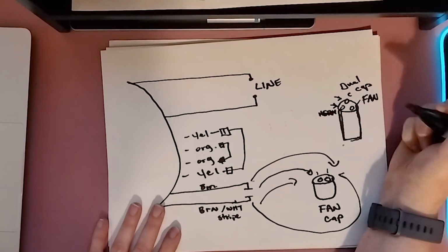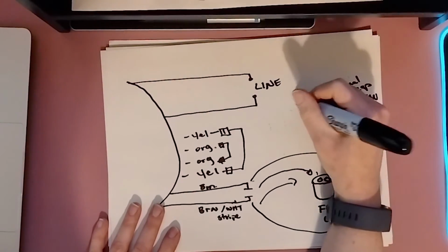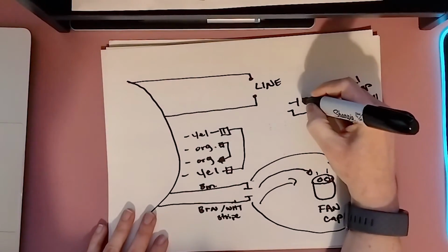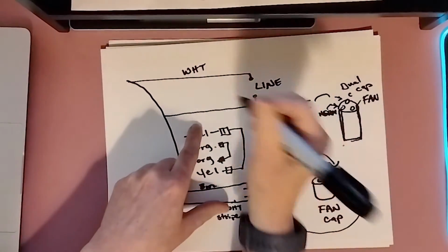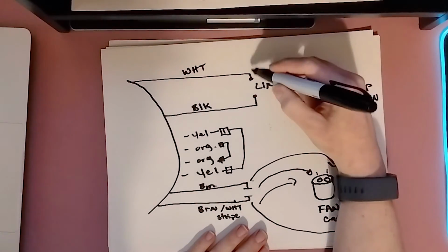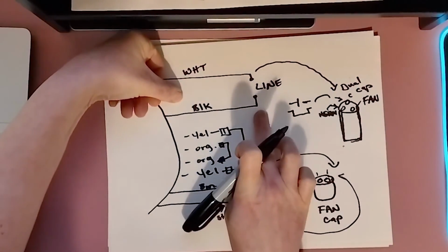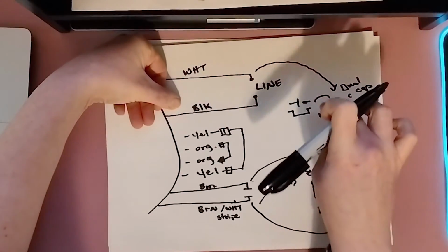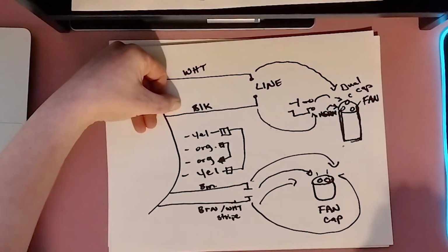Your compressor still needs power. So that compressor wire needs to stay on there, and that power wire that's jumping over to the contactor needs that power. In order to make this super simple, because there's a number of ways you can do this, put your wire, and again, we're just using placeholder colors here. We know line and line. Well, keep whatever color this was before, keep that where it was before. Keep your other line on, which side was it again? The opposite side of where your jumper wire comes off your C. So then that wire goes back to the other side of the contactor.